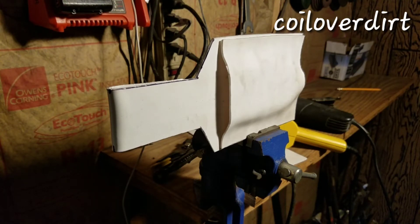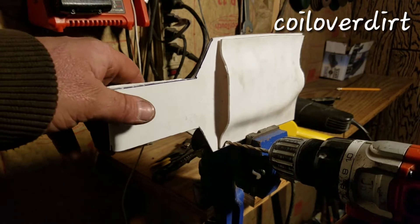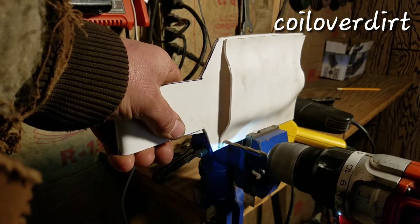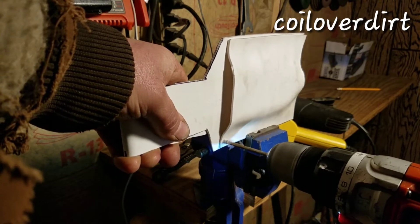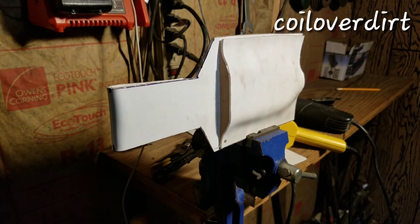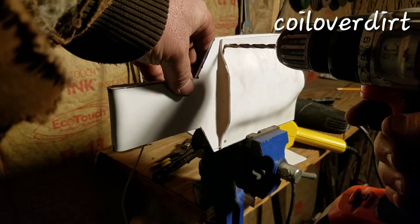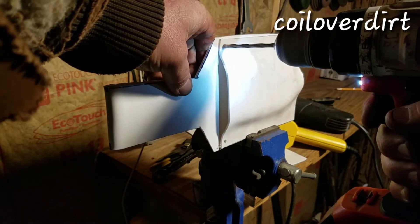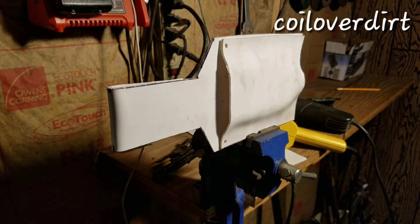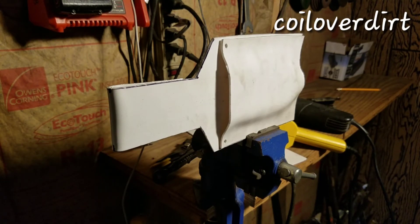Okay guys, I was wrong on the size of that copper — it's actually 11/64ths. And what I'm going to do here is drill my first hole to put the first rivet in, to draw that a little bit tighter. That drill bit sure could be a little bit sharper — I think it's a little bent, too. We've got some room here to play with because around these edges here, I'm going to be shaping it to the way we need it to be. Let's get these two done and then we'll get back with you.